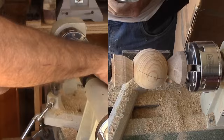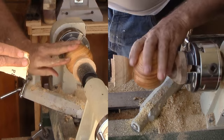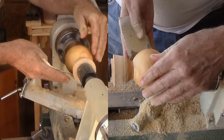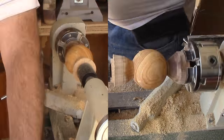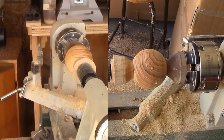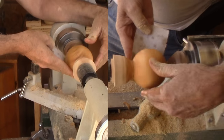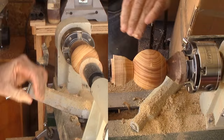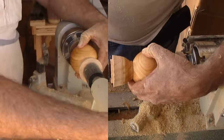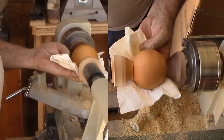With as much done with the tools as I can, I'm switching to sanding. Since this ball is for a baby, I'll finish it with a non-toxic finish which also happens to be my sanding media: beeswax and mineral oil. I'm sanding each grit with the same three rotations as the cutting tools — meanwhile my hands feel smooth and soft and smell like honey. Finishing a hollow ball blind is a risk of cutting through, but careful measurements on the outside do limit the risk. I do have some slight marks from my cup centers since I did not pad them, but this is still perfect for an 18-month-old little boy. A three-inch lightweight cedar wood ball with a bell inside — the bell is too large to swallow if the ball is broken, and the ball is finished with a non-toxic, renewable finish.